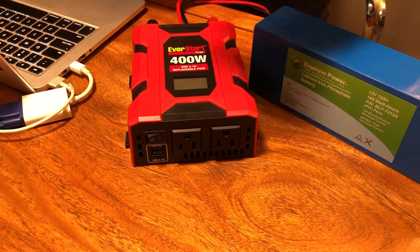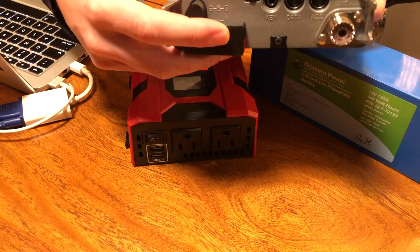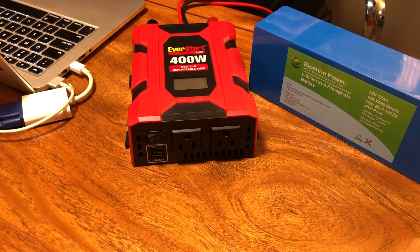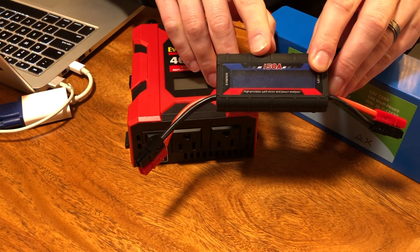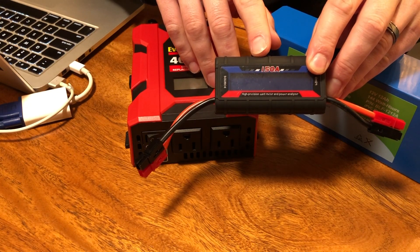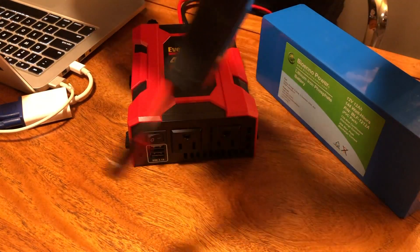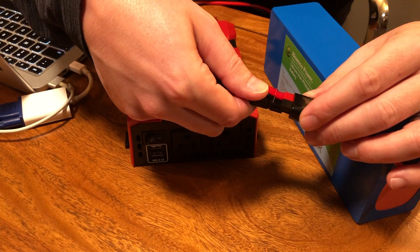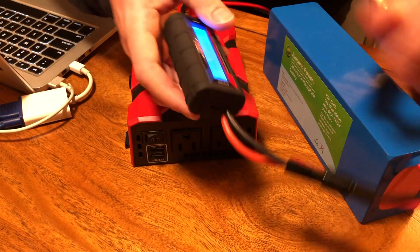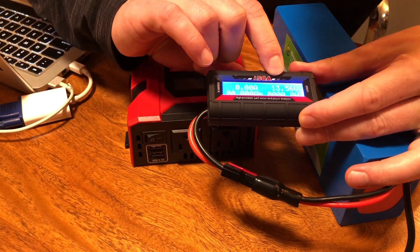Okay, let's get to the fun part of the video. We've already discussed that I can connect my ham radio directly to the battery using the Anderson power poles. So before we get started, let's go ahead and plug everything in. Just for testing I'm going to put my inline volt and watt meter in so I can see how much current is going through. We want to connect the source side to the battery, making sure we have the polarity correct — red to red, positive to positive, black to black, negative to negative. And you can see the battery is fully charged at about 13.5 volts.